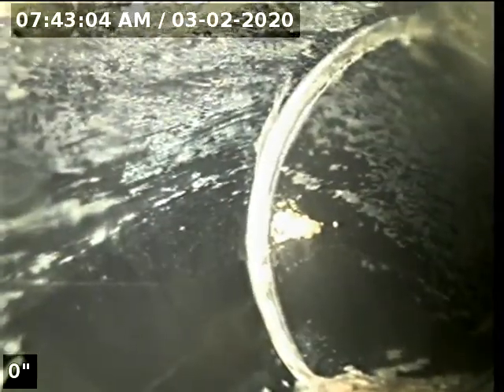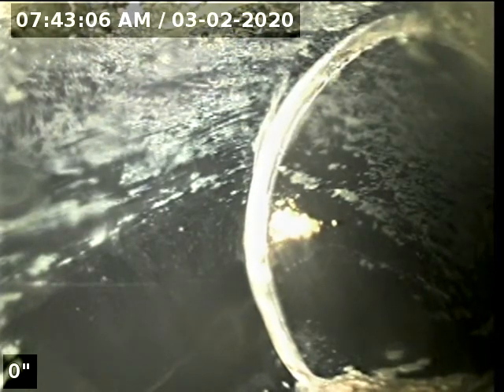There's a west street here. Here's your front entry and there's your driveway. Here on the southwest corner of the house in the front facing is a 3-inch ABS clean-out. This is where I'll be accessing the line for inspection.